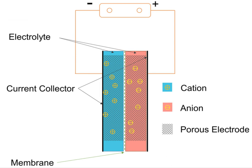Current load and cycle stability. Because supercapacitors operate without forming chemical bonds, current loads, including charge, discharge and peak currents, are not limited by reaction constraints. Current load and cycle stability can be much higher than for rechargeable batteries. Current loads are limited only by internal resistance, which may be substantially lower than for batteries.